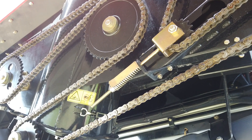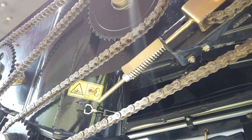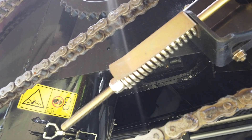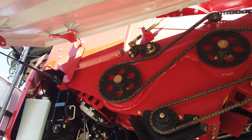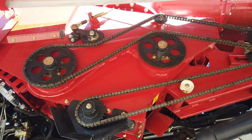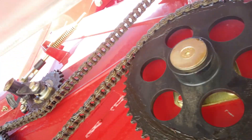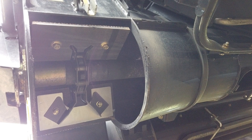The remaining drives on this side are belt or belt and chain drive. Tensions need to be checked on all belts and chains every 50 hours using the spring length indicator plates on the tension arms. Please note that excepting the feeder and grain elevator, all chains should be lubricated at the end of each working day. The chain will be warm and the oil will penetrate the links to provide excellent protection and lubrication. The feeder and grain elevator chain can be lubricated at the end of the season or before any length of storage.